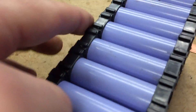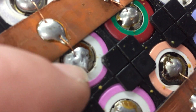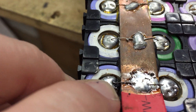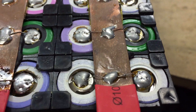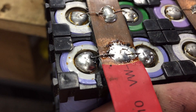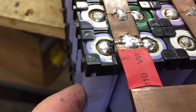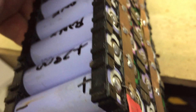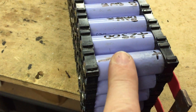I've run my multimeter over this and found that one cell there was connected properly but I must have left the plastic coating on the wire, so therefore it wasn't working. That cell has now been reconnected. And I found one with a broken fuse — it looks like this end lifted up or something, I've been too rough with it and broken the fuse. But in reality it wasn't this that broke the fuse — it was the cell itself. This cell is stuffed. Looking at it closely, you can actually see rust underneath the actual cell. It appears to me that that fuse actually did its job. It's showing millivolts — the cell is completely dead.